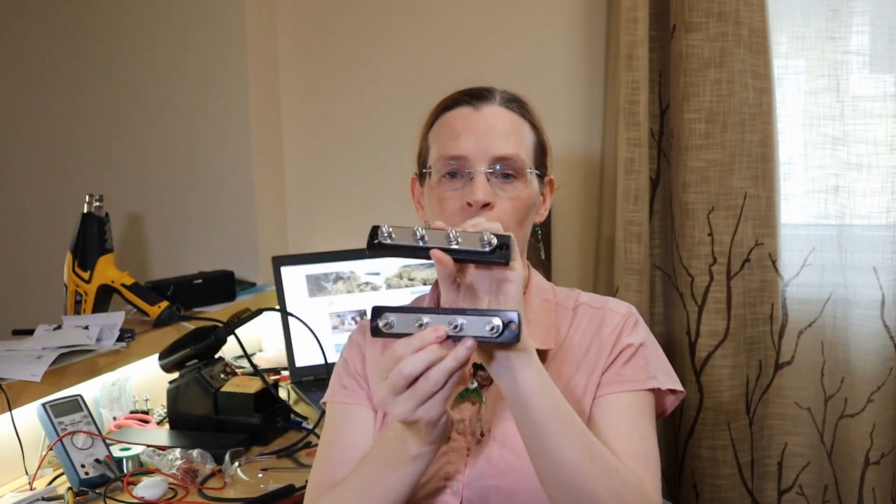So one of the ideas behind why I added the bus bars now, originally when I got the Victron out and I was ready to assemble it, I was thinking I would just hardwire everything and then come back and add the bus bars later. Why rush? Why not try as best as possible to do things the right way? I know I'm going to need the bus bars for connecting the solar chargers, something I've not yet talked much on the channel. I've got a couple of 330 watt monocrystalline solar cells on my roof. They're not run down from the roof yet. The conduit and stuff's there, but I haven't actually run the wire because I've been learning the battery itself. When those get brought down, they're going to be tied into the ground and positive bus rails. So that's it. Just decided to do it now.